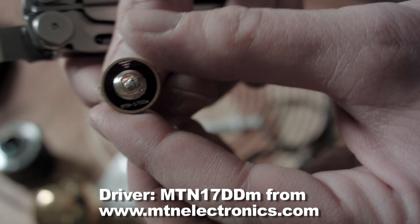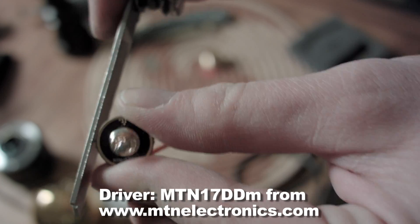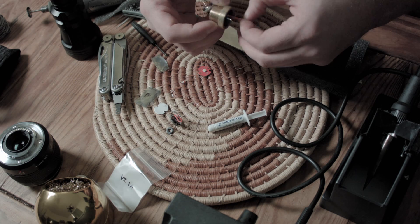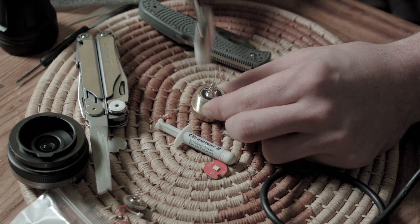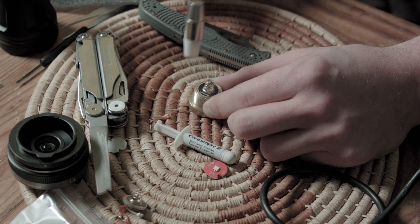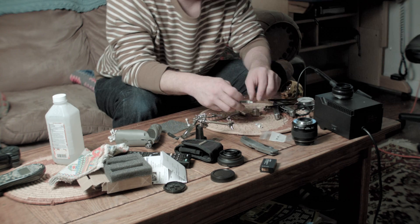I file the burrs on the edges down on the outside of the driver, put the positive and negative leads through the hole, and hammer it lightly in until it makes contact with the interior brass lip. The ring on the outside of the driver is a negative or ground, so it needs to make contact with the brass module to make the flashlight operate.